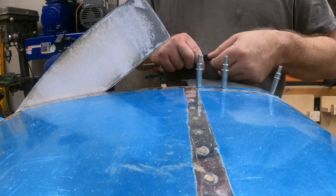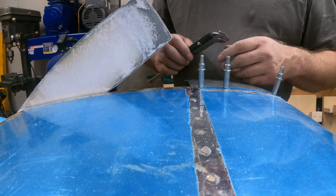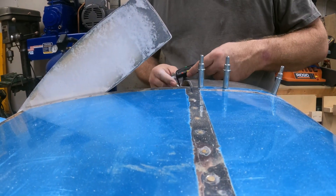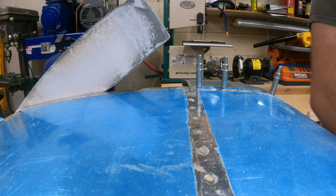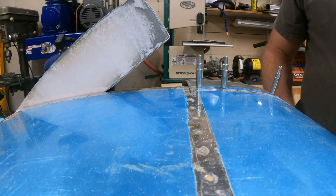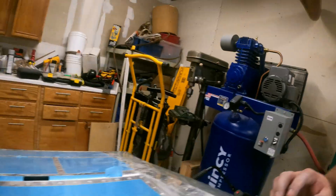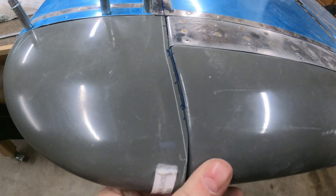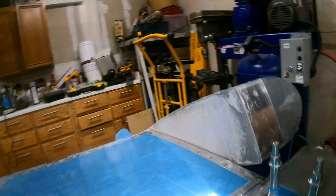Now that that's done, I take my calipers, set it for the 1/8 inch gap. Since I'm just clear, if I just score along there, now I know exactly what an eighth inch back from the elevator is. You have to have a minimum of 1/8 inch gap, so even if I go a little bit over that's fine — just don't want a ridiculously large gap. You can see here I'm going to be 1/8 inch back from the edge of the elevator, because I went to just barely clearing.